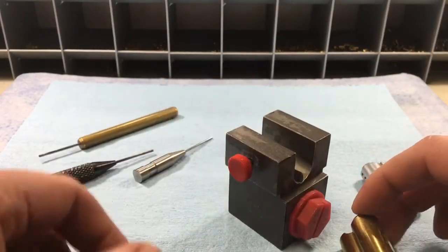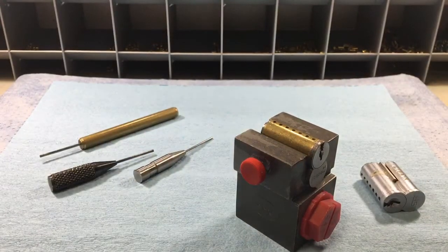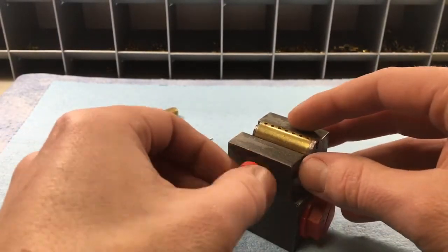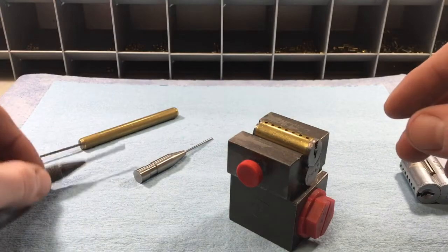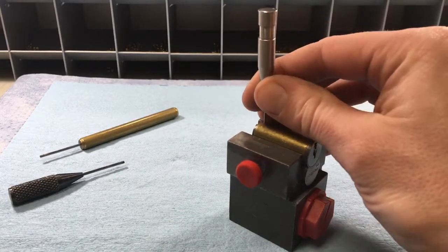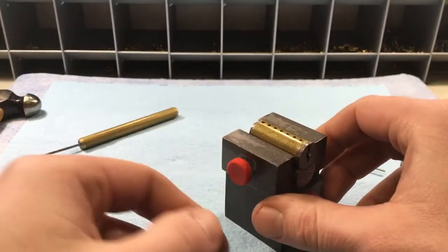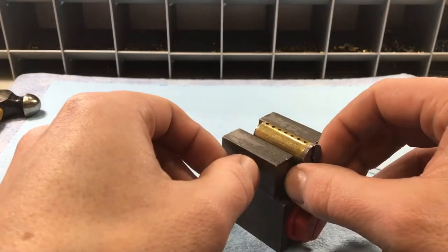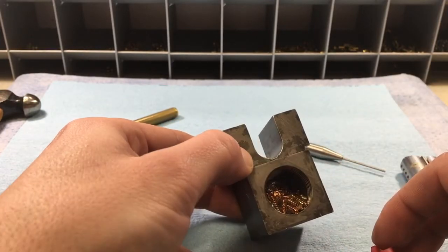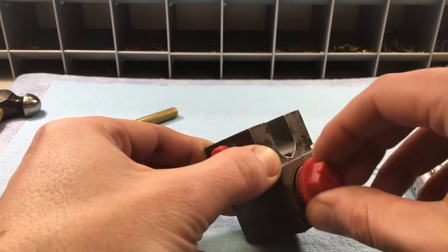There's also a larger diameter ejector pin made by A1 — it's suited for standard small format but not necessarily for Key Mark. When you have these ejector pins, you'll need a way to get the pins out. This is what's called a dumping block, made by A1. You slide the core in upside down, tighten the set screw — not too much or you'll deform the chambers — then lightly tap the ejector pin with a ball-peen hammer. You can go chamber by chamber until the block fills up, then unscrew and dump it.